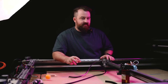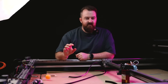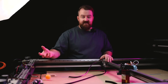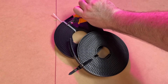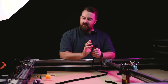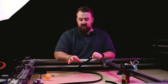It increased the resolution I was getting out of the machine, though it's still not perfect. Just before I get into the experiments, if you watch episode one you'll notice I really wanted to build a CoreXY machine just to investigate and explore this type of kinematics — it wasn't built for any specific purpose. I didn't really know what belts to buy and, thinking it was going to be such a large machine, I wanted something with a lot of rigidity in the teeth, which is why I chose the 5M belts. In reflection, I probably should have gone with something less rigid that could be tightened more and allow those teeth to flex over a smaller surface area.